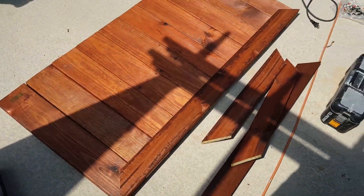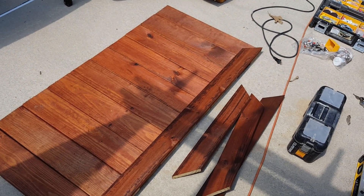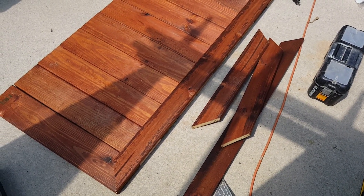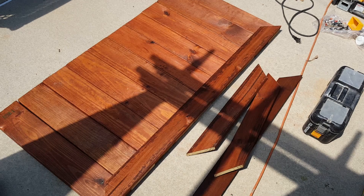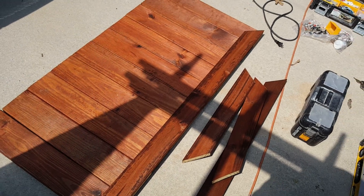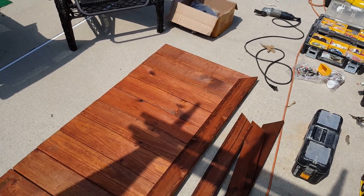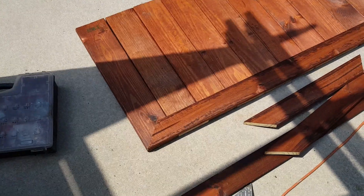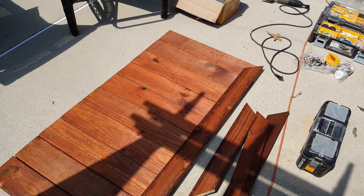Now for the door — it has ten boards and mimics almost the height of the walls but just a little bit lower, since those were designed for privacy. We're going to cut the frames at 45-degree angles and on the back we're going to put a transversal piece to avoid the door from sagging and collapsing. We're using inch-and-five-eighths screws. We have self-locking hinges to keep the door closed, with a little space so it closes properly, plus a door stopper.